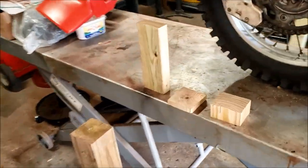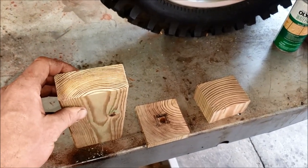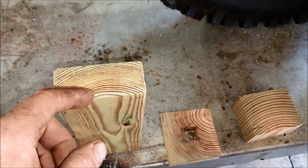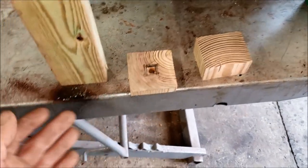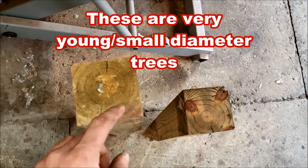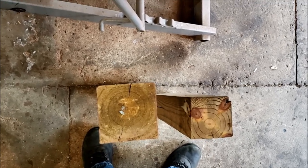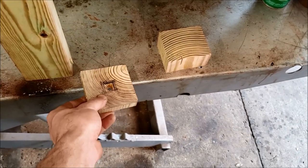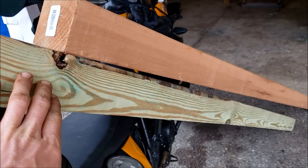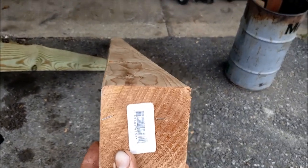Quick tip that most professionals probably already know: when choosing wood for your 4x4s or 2x4s, make sure to try and get number one pressure treated. As you're choosing it, try to find wood that has very tight growth rings, because that tells you the tree is older and will be much more stable wood. If you choose a center cut 4x4 from Home Depot with wide growth rings, it's very unstable and will likely end up twisted. Tighter growth rings give you a much better chance of staying straight. Cedar is another option — it really stays nice, true, and straight.